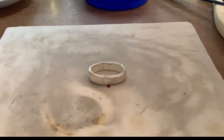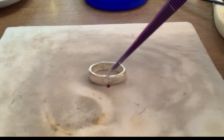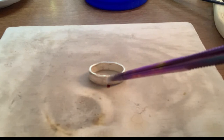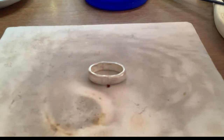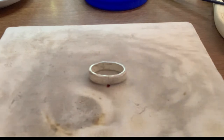I'm going to use my tweezers that I use for everything, because I always inevitably singe up my flux brushes — so I gave up on that many years ago. I'm just going to put a little flux on my seam and make sure it travels down to the solder. If anything moves out of the way you can tweak it around, but it's sitting on there pretty well.